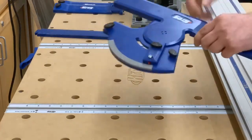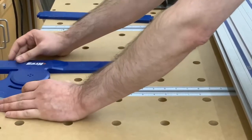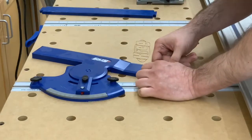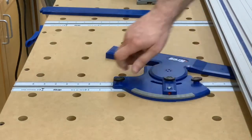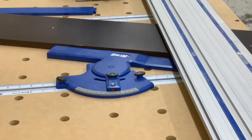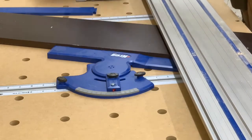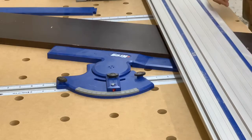There's also an angle accessory for doing angled cuts. If I need to cut at 22.5 degrees, I unlock it, pivot it over to the 22.5-degree mark, slide it into position on the table, lock it in place, and slide my workpiece underneath. Wherever my cut line is, I'll get a 22.5-degree bevel. The Versa stops and all these accessories come included with the main table.